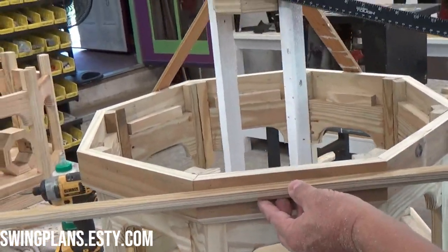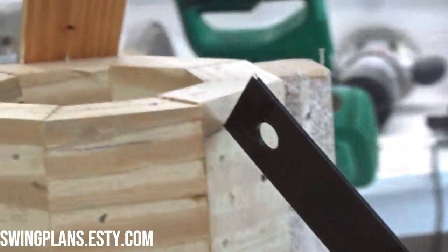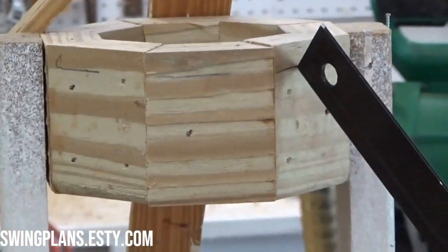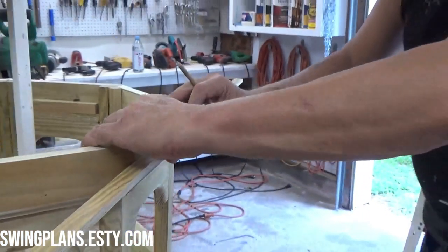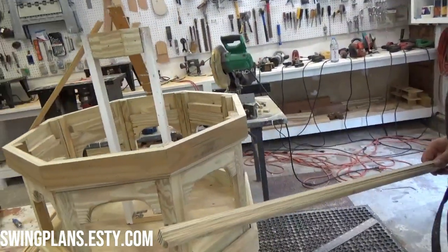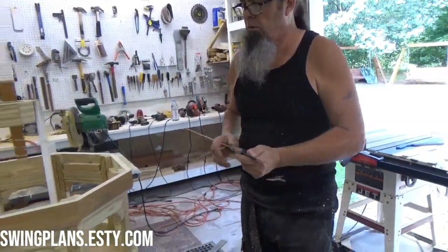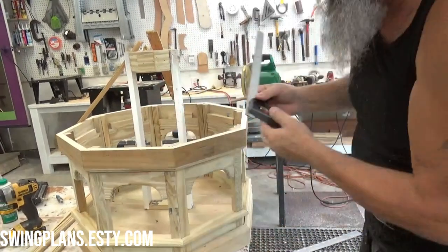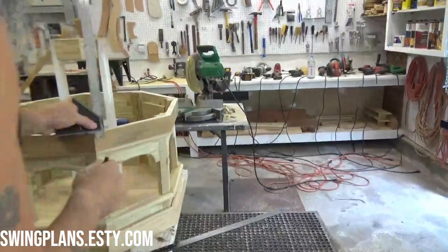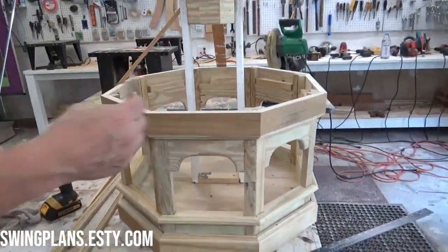This is where the top of our roof is going to be. Okay. So we'll hold the straight edge right like that, and then we see where it intersects. That's where we want to mark it. Right there. Like that. Okay. So what we'll do is find out this measurement, and we'll go around and mark it. And that'll be where the top of our drip edge is.